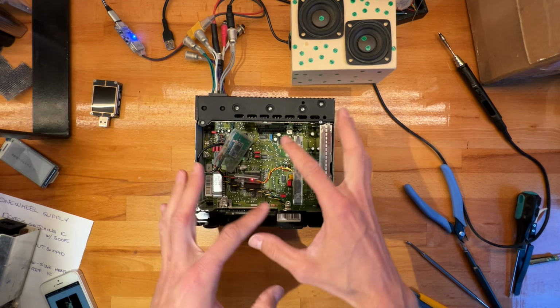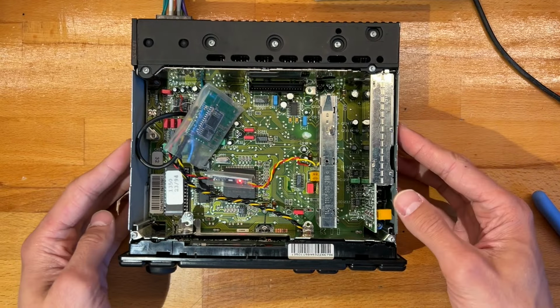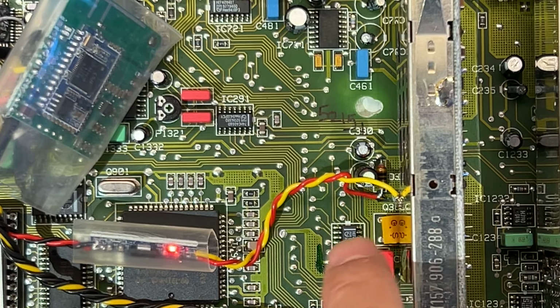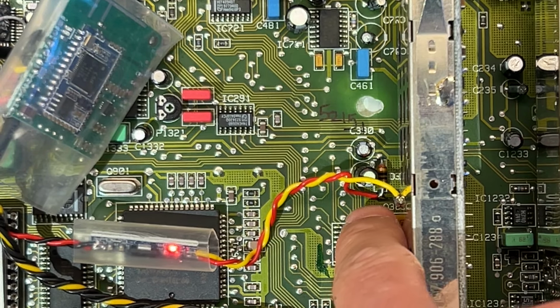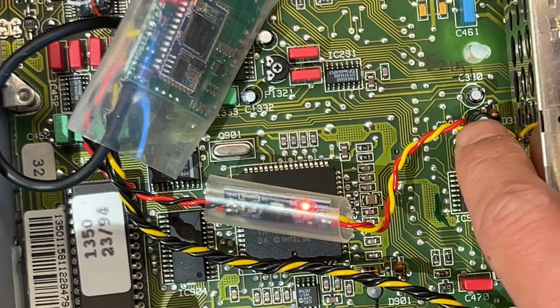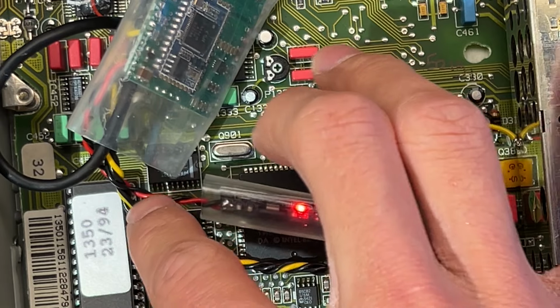Over inside, they are a bit different. I'll show you guys the diagrams I've made. But first, let's just have a broad overview of what's happening. So we're getting power from the AM circuit. It's going into a linear regulator. It's about 7 volts or something, and it's taking it down onto 5.